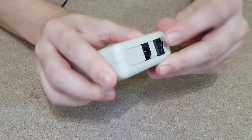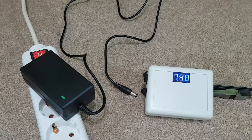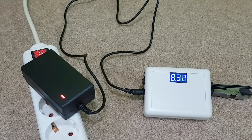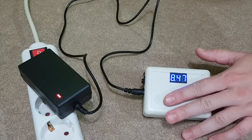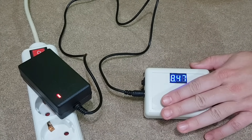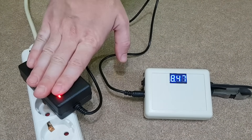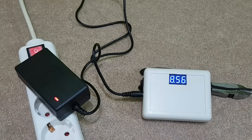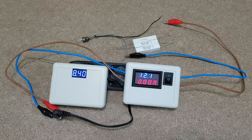I will tighten the UPS box with the 4 screws it came with. The switch needs to be pushed into its place. With all the testing, the battery got a bit low on voltage, so let's charge it. After one hour of charging, I test the temperature with my precision sensor — the UPS is slightly warm and the charger is between warm and hot. The charging is finished after another half hour. You can see the charger red LED turns green because there is just a very small load now. The voltmeter is showing 8.6V, but this is the charger voltage — the battery remained at 8.4V.